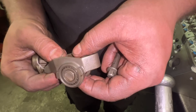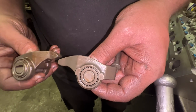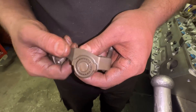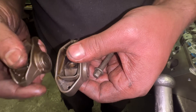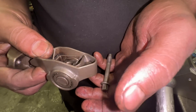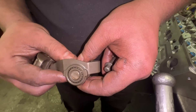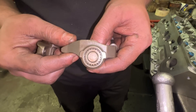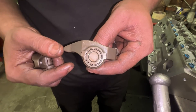The main advantage to all this — and why you wouldn't just go buy a set of roller rockers — is these are almost free. You can find them in any junkyard. They do come in some V6s, so verify you have the right ones — they're going to look like this roller-style rocker, not a stamped steel rocker. I bet you could get a set of 16 of these for about 50 bucks, and you're looking at 50 bucks for the little thread adapter — so 100 dollars total. These are reliable roller rockers versus buying cheap Chinese ones where you don't know the reliability.